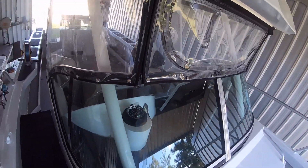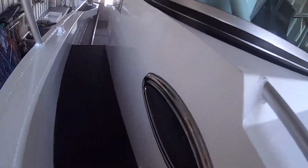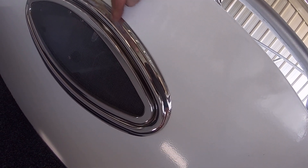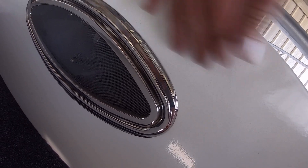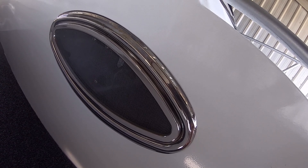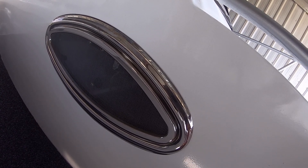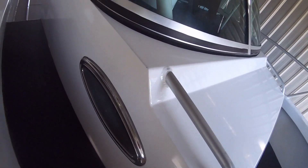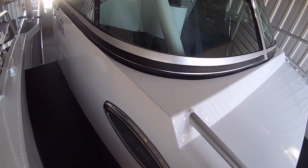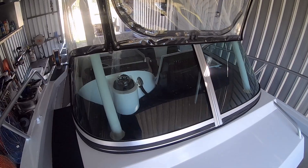Only if it's big seas or really raining. These windows are looking alright — there's maybe a tiny bit of surface rust coming through there, but they seem to seal well. They weren't sealed when I got it, so I just unscrewed them, put some silicone around, and put them back in. I had to do the windscreen bolts as well because it was leaking — a bit of water was coming in there. That was one of the other things I had to do, but it wasn't a big drama.